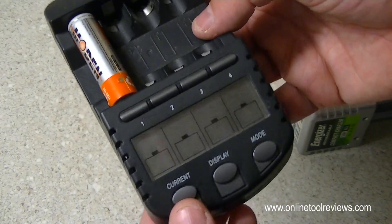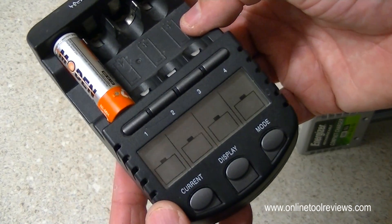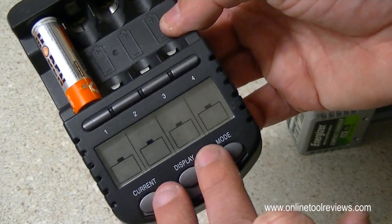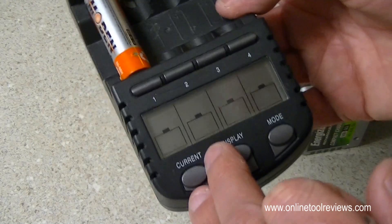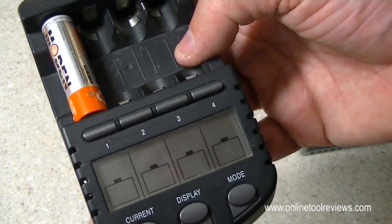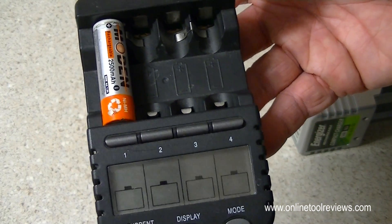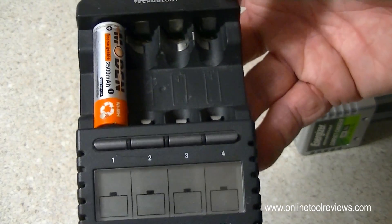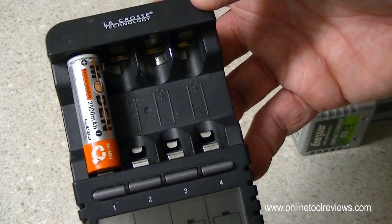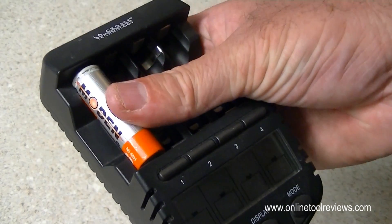The other advantage of this being a smart charger is that it detects voltages and other parameters of your battery to prevent it being overcharged. In addition, this particular model will allow you to charge at three different current rates — 200, 500, and 700 milliamps. So it can charge fast in a couple of hours depending on the capacity of your battery, or you can set a slower charge rate to charge things overnight. Generally speaking, using a slower charging rate is better for your battery cells; fast charging can sometimes degrade their life or their cycle count.